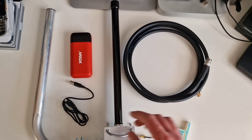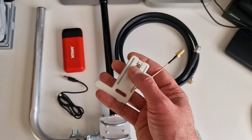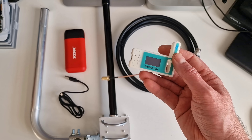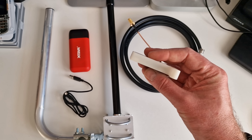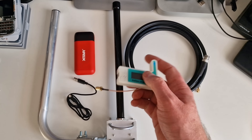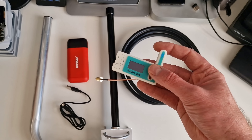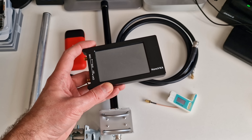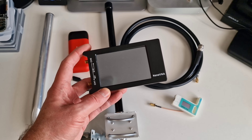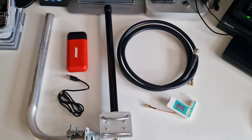You might be wondering why I'm using a USB power bank - it's a really easy way of doing it and you don't have to worry about batteries. These ESP32 LoRa boards, the Heltec ones, are not very power efficient, so you will get through power pretty quickly - a little power bank might only last maybe two days. But this setup is in a shed so it's easy to charge the battery pack or swap the 21700 batteries. I've also got a NanoVNA for testing SWR, to check your antenna is working okay and connections look good.